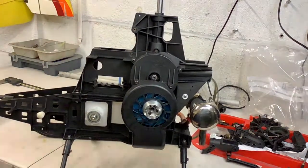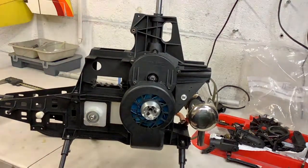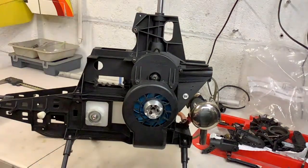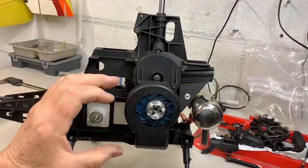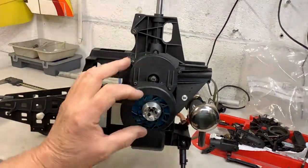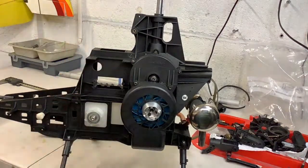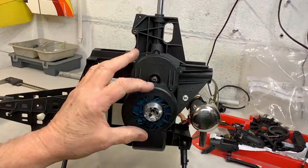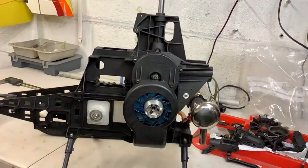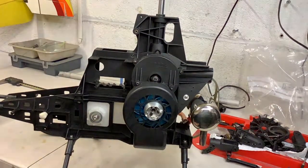And I thought it was a heat or a seizure or something like that, but I believe there's a big mark in the top of the piston. So I think the guy did actually try and lock the engine up to do this up tight, because it's really awkward to do it up. You've got no collet, it locks up. So when you try and tighten it, you're going anti-clockwise, which wants to turn everything off it.